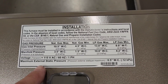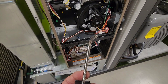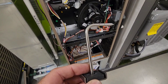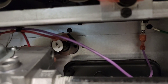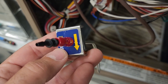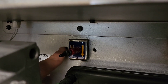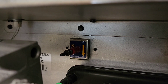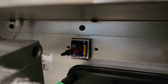If we pull the cover off this furnace, this particular machine is asking for a maximum external static pressure of 0.5 inches water column. Static pressure tips are closed on the end but open on the sides — as that fan starts up we create a ballooning effect in the ductwork and that pressure inserts itself into those little holes back to the manometer so we can read it. I've removed the high limit switch, which gives us access to the top of the cabinet where we can insert one of our static pressure tips. Each static pressure tip comes with an arrow indicating the direction the tip is pointing, and I've installed the first tip with the arrow pointing down.